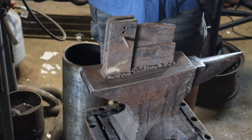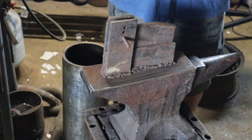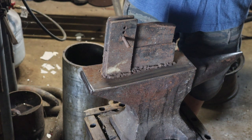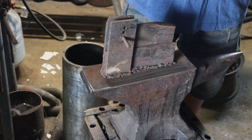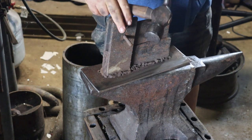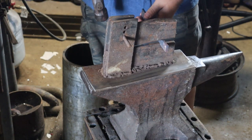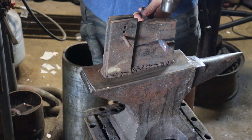Now, what I normally use is a chop fuller, and this is a one-person way to fuller. Now, I made this well over a decade ago, and I didn't even weld it. I had somebody else. My welds looked worse at the time. But how this works is I've got it through the hardy there, and throw the material in when the material's hot, hit the top, and go.